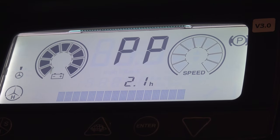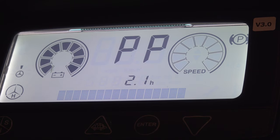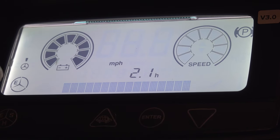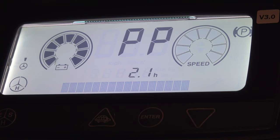One of the really nice things is the information center and dash display. You can see the ESH setting — three predetermined performance levels: Economy, Standard, and High Performance. Economy means slower travel and slower lifting, using less power. Standard is a bit faster. High Performance is the fastest predetermined speed for travel and lift. These are adjustable, and High Performance isn't necessarily the absolute maximum the truck can go — it's a preset that can be customized.